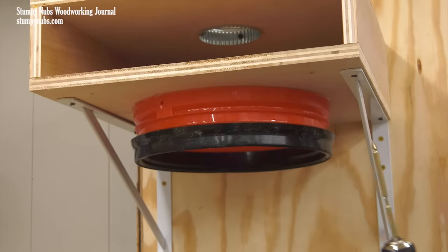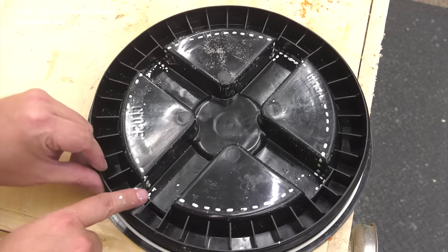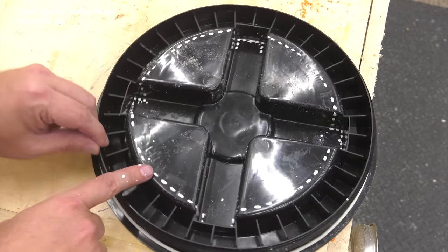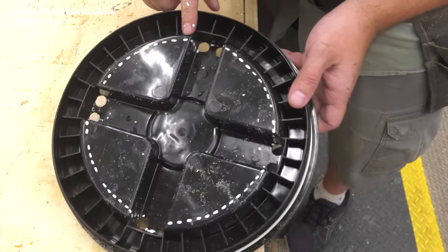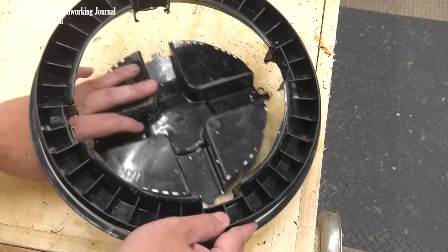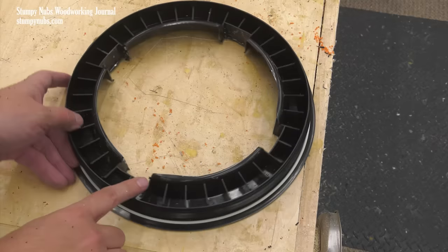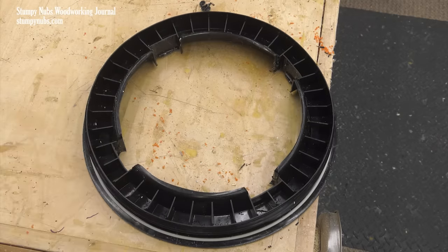Put the box on the brackets and secure that with screws as well. Now back to that center portion of the lid — the middle must be cut out along the dotted line that you see here. The easiest way to do this is to drill a pair of half-inch holes in the underside where each cross member ends, then use a jigsaw to remove the rest. Note how the ribs are all left intact — this is important. Make your lid look like mine.